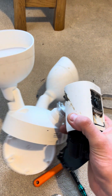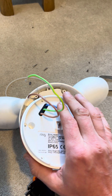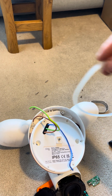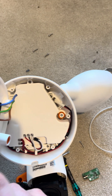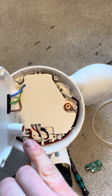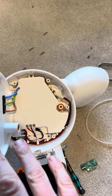This is the main electrical input — UK spec, so it's 240 volts. You've got six screws around the outside, an O-ring that seals it to the back plate, and the back plate has its own water drain, so they really thought about that. Inside there's another silicon O-ring, and that just gives you access to the main driver. You've got your 240-volt input, a driver output that's probably 12 volts, and then a 5-volt rail that must go through to the control unit. Even where the unit bolts through to the back plate, everything's got its own O-ring.